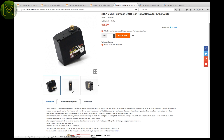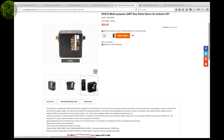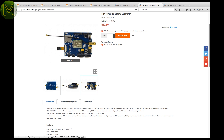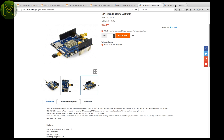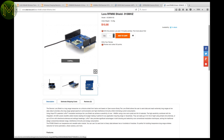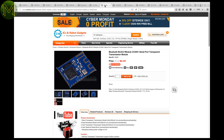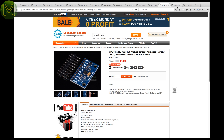And this is really cool — similar to servo modules mentioned in past roundups, this is a servo that has inbuilt positioning and is controlled via a 3-wire interface. It's bi-directional, so you can set the angle and query its temperature, load, speed, and position. There's also a GPRS GSM-based shield with onboard camera and SD slot, supporting all the usual GSM functions like SMS and voice calls — but remember, GSM will be phased out in most countries, so it might not be worth getting. A cheap 100mW LoRa module based on the RFM95 chip gives you an effective 37.5kbps bitrate — a decent enough LoRa module for that price. IC Station also have a whole bunch of Bluetooth modules — CC2541, CC2640, NRF51822 — as well as ultra-cheap BeiDou/GLONASS GPS modules, and motion, current, pressure, temperature, and humidity sensors.